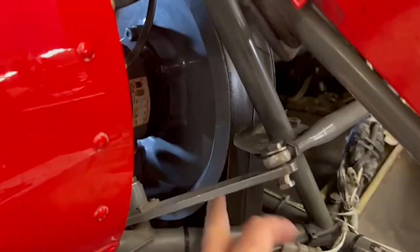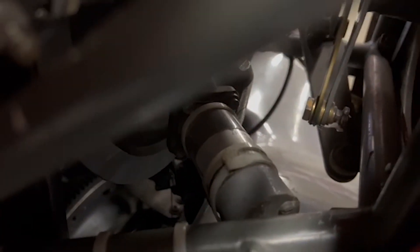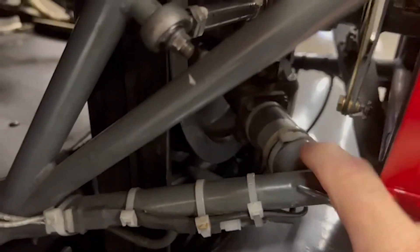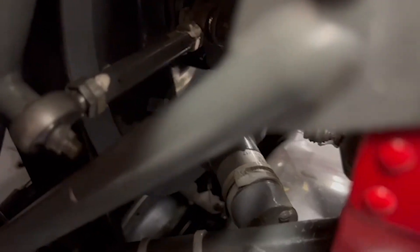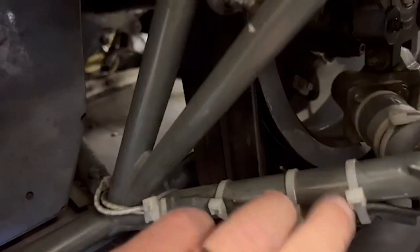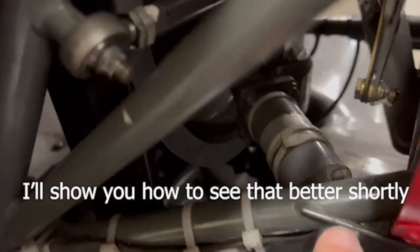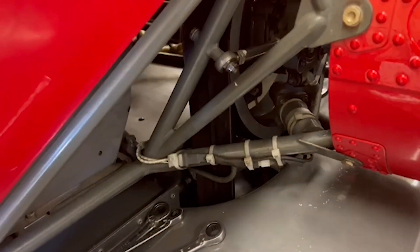In this case, the upper sheave is too far to the right, and that belt was touching the back of the frame right here. On the other side, if the sheave is too far to the left, you'll notice there's almost no clearance between the back of this motor that runs the screw jack and tightens up the clutch assembly - basically tightens the belts up. On the front leading edge, if it's touching on that side, you'll see scuffing or scrape marks on the housing of that motor. So those are two areas we need to be looking at much more carefully on pre-flights.